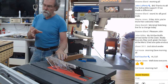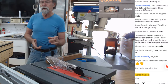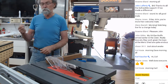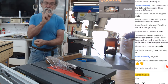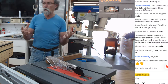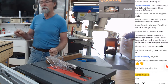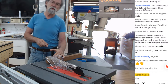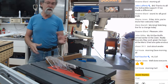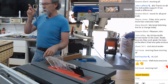Just a quick explanation about that. Say I had two 1500 watt kettles. I don't know why, but I'm just trying to explain it. I plugged both of those kettles into this guy, two 1500 watt kettles, and that will pull 3000 watts, 3 kilowatts. Not 3 kilowatt hours, 3 kilowatts. And it will do that for around 2/3 of an hour, so that is 40 minutes. It will run the pair of them off that one unit without an additional battery. And you can put 5 batteries on this thing. It's insane. Anyway, where am I at? What was I up to?